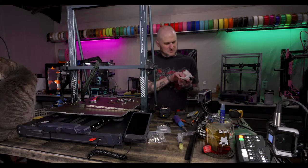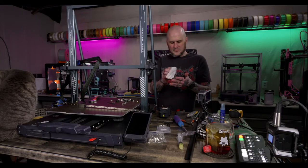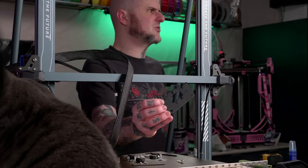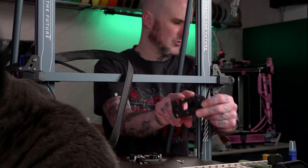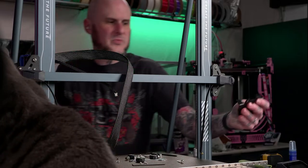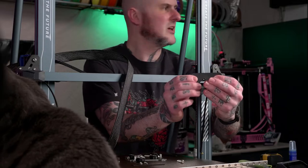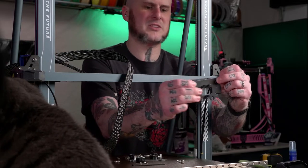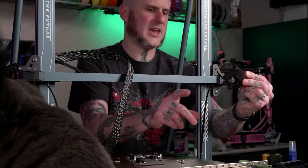All right, I'm gonna clean this off. This plate's greasy from the wheels. Cool, there's what we need. The original carriage plate with the wheels taken off of it. Our new mount, I'm pretty sure, is going to mount to these two screws. Where is it here? Yeah, here it is. Our new mount mounts, I have it upside down. It mounts to these two screws, the top two. So that's our linear rail mount. It'll mount to that, and then we'll have a solid connection between the linear rail mounting and the carriage plate.